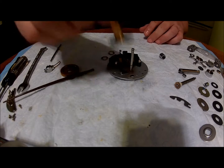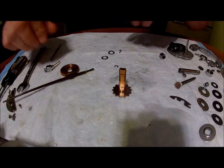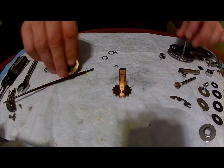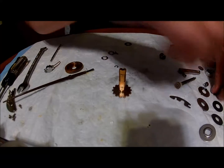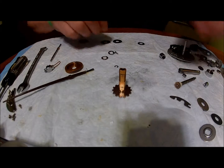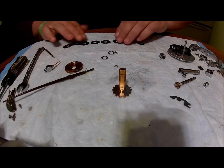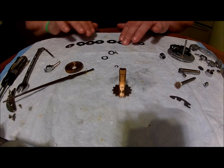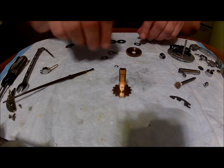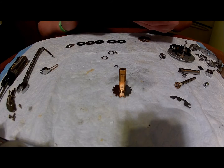Now we're going to grab your main gear holder. We'll set this off to the side right now, and we're going to build your gear. First things first, actually, yeah, I can't forget to put that drag washer. I like to line things out before I do them, if you ain't noticing. This goes on the bottom of this before you put that on there. First thing I want to do is actually put a little bit of grease on my bottom washer here.